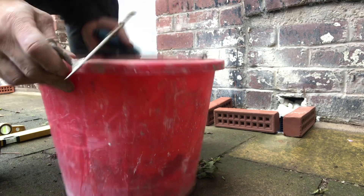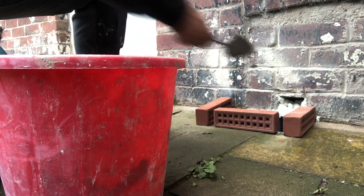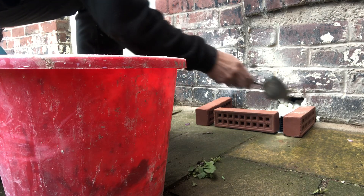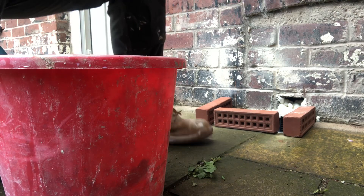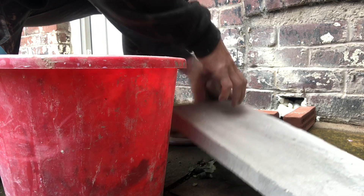First of all, I've got my mortar mix — three and one, building sand and cement. I've put these in line, I've measured them across, I've marked them, put marks on, put a mark on the wall there — they're both 38mm. Left a little gap here, it's just straight. I've already cut this, which is a flag. I've got two to do so I've cut it in half.